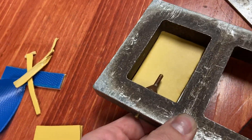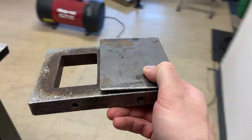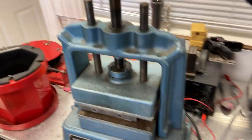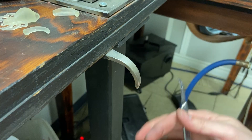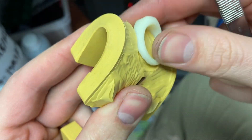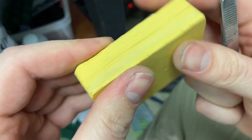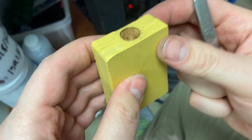Moving on, I took a vulcanized rubber mold of this model here, which is just a pretty standard ring, and it works flawlessly — no warping, absolutely perfect. I can confirm that this is heat resistant up to 350 degrees Fahrenheit. I expect this will go much higher, but I'm really not equipped to figure that out. So confirmed, this resin is vulcanizer safe.